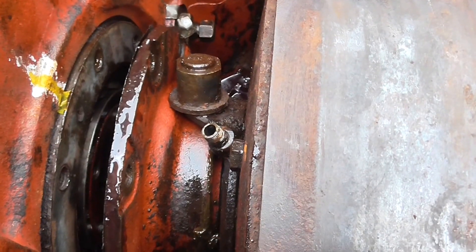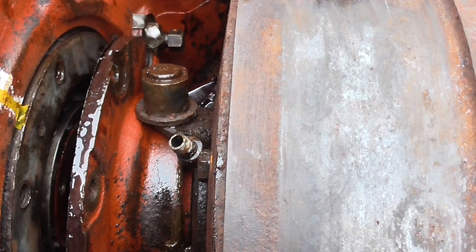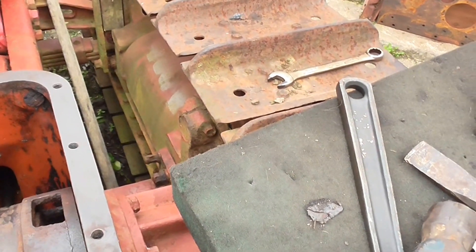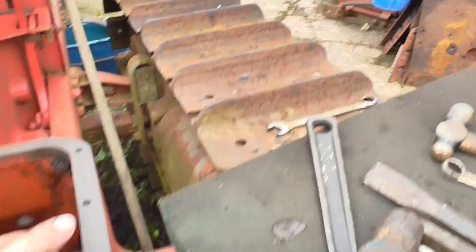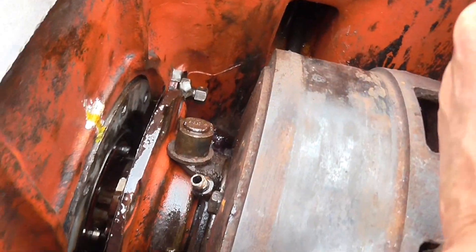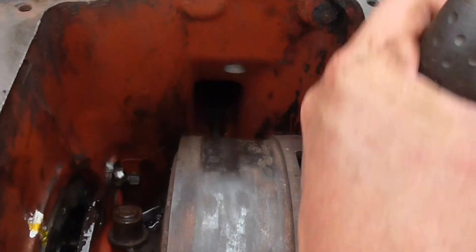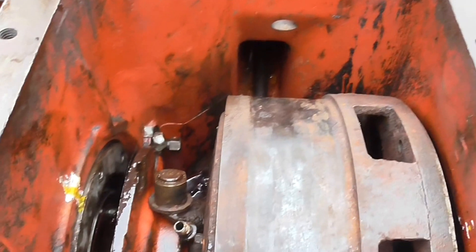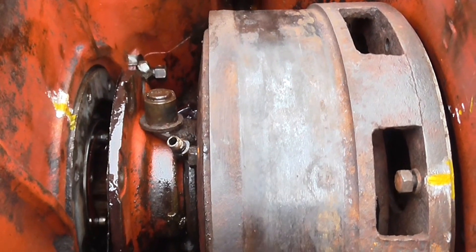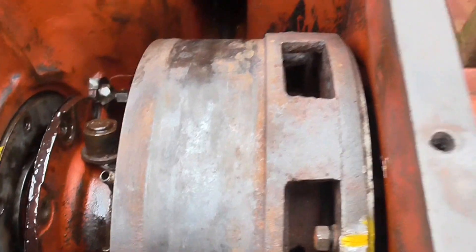The actual dog which slides into the internal gear looks in pretty good condition. The right-hand track — you can bar around quite easily, you can move it now, and I can get to all the bolts. She's ready to lift out now. Not the best job in the crawler, especially when I think it's going to hammer down with rain in a minute as the wind is picking up. I shall report on what I find inside when this clutch assembly is lifted out.